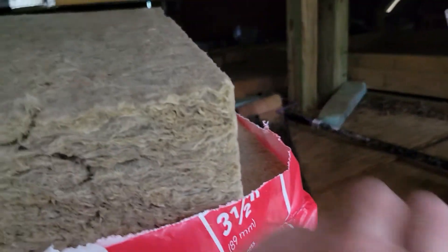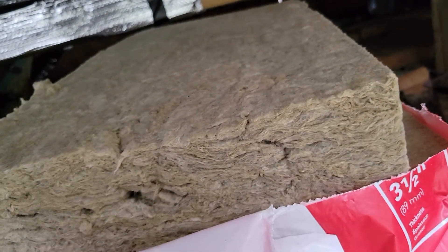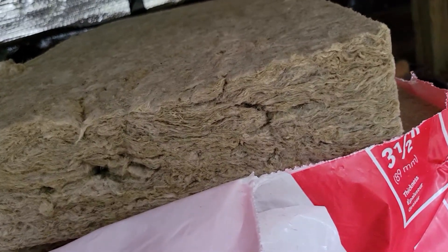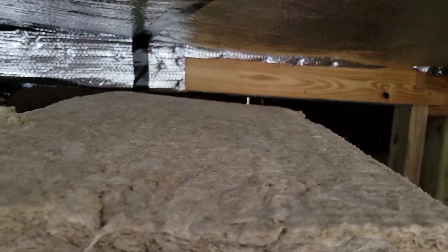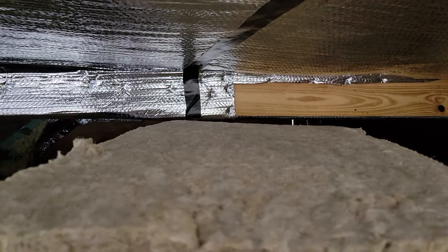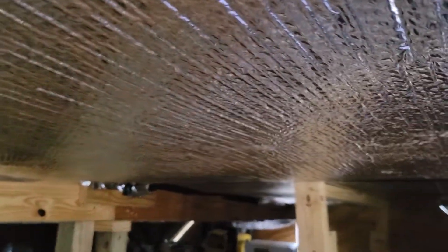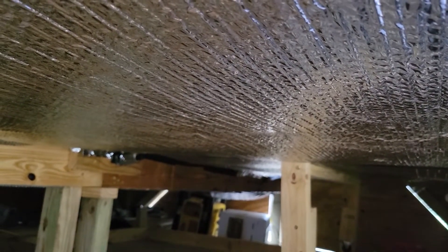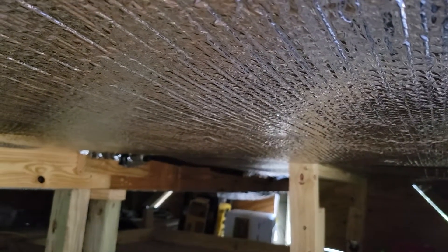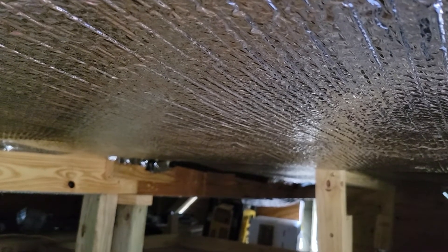I put three and a half inch rock wool right here in between the floor joists — that's R15 I believe. And then I got about a one inch closed cell foam underneath the floor joists on the bottom of the plywood, so that's about R5. Anyway, I think it's really worked well. I'll let you see it in case you might want to do it yourself in your crawl space. That's about it, thanks for watching, bye.